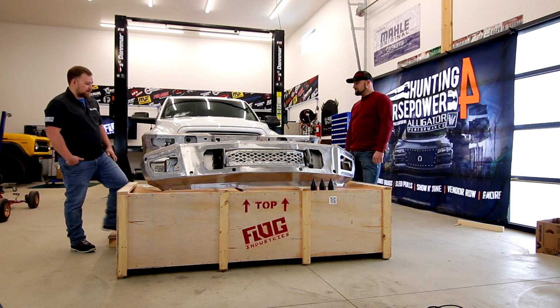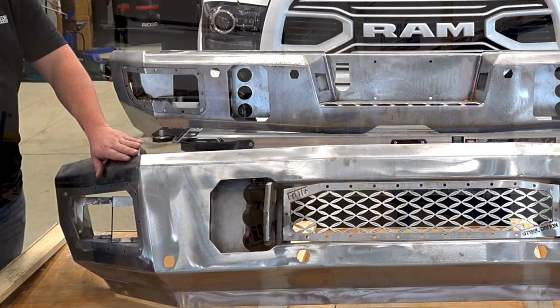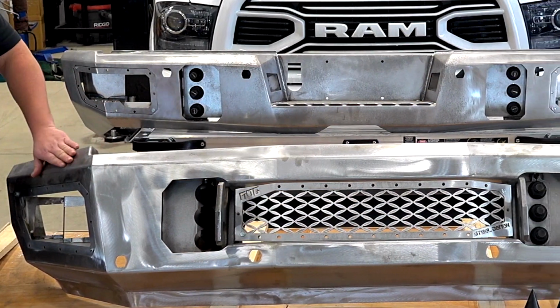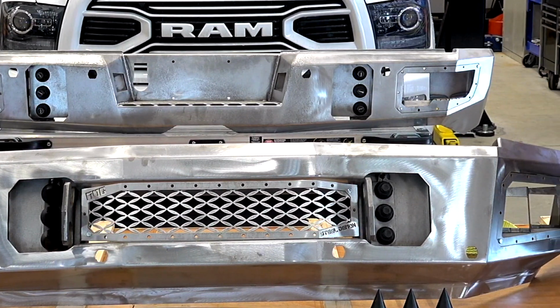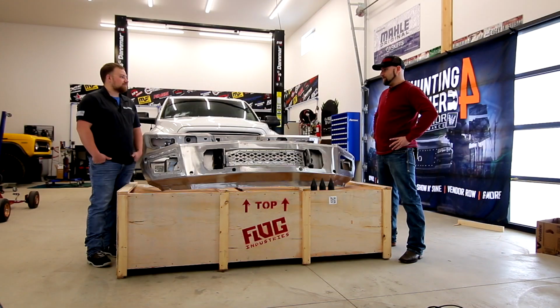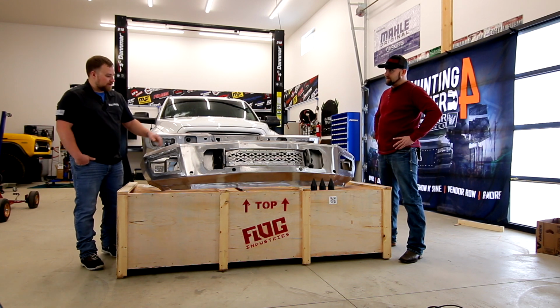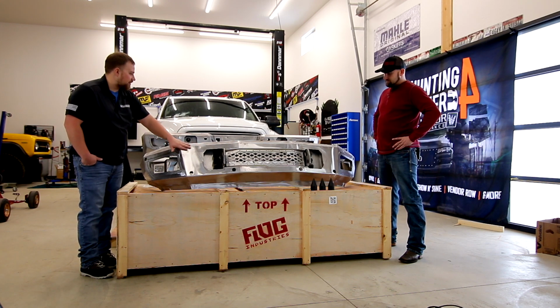For sure, and talk about finish. It seems like you go the extra mile on the finish. It's not just standard grit sandpaper. We actually use an automotive sanding wheel on our finish pass, so when they're delivered, they're ready to go to the paint shop. Yeah, they seem paint or powder ready. There's not really anything that's deep. It's a very, very nice finish.